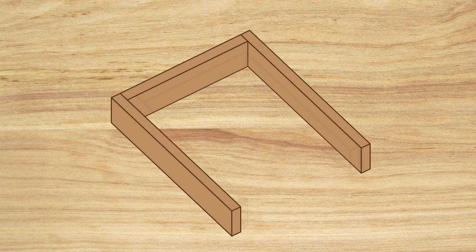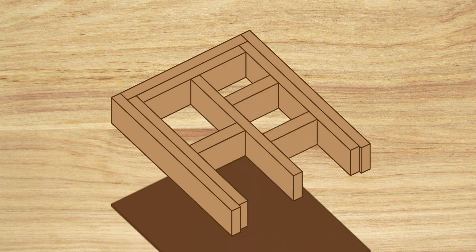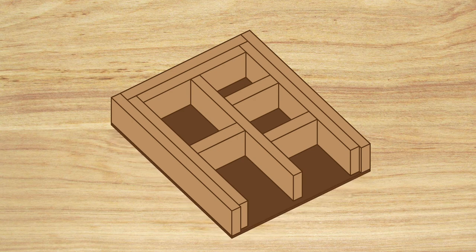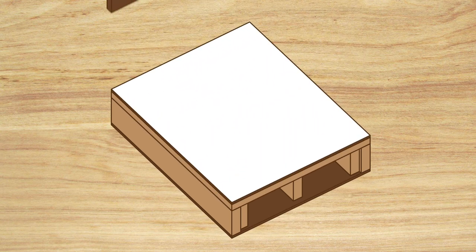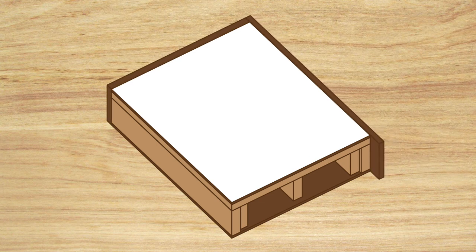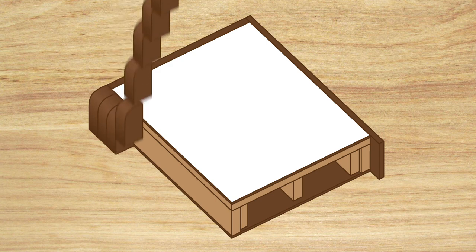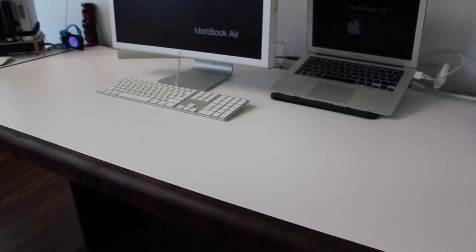Here's why it's awesome. It starts with strips of plywood as the inner core, making a torsion box that's lightweight and very strong. A thin piece of hardboard on the bottom, thicker plywood on the top, white countertop laminate, and the whole thing is wrapped in solid walnut, with one side being thick end grain with a huge round over. It's kind of like a cutting board, and it's awesome! Here's a close-up of the trim.